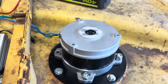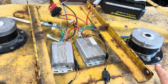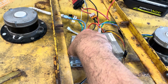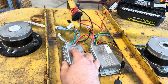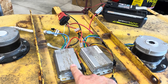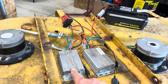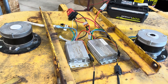One downside to the brushless stuff is it's a lot more wires. I think when I'm done I'll mount maybe a piece of wood or plastic here and mount these controllers upside down under it, so it'll look nice and clean and be out of the way. I've checked that these particular controllers do not have a tilt switch — sometimes ones used for lawnmowers do, so if the mower flips over it automatically turns off. I tested these and they do not.